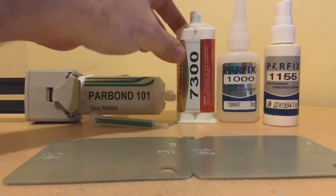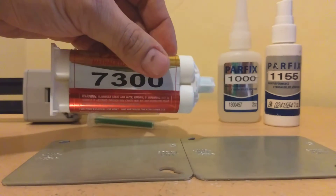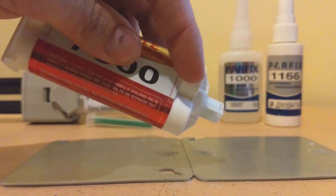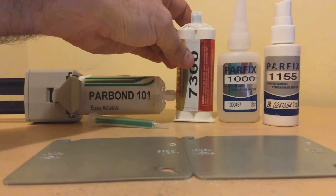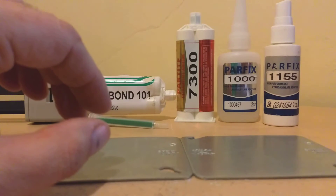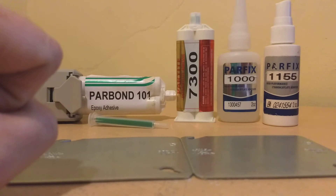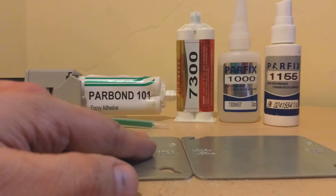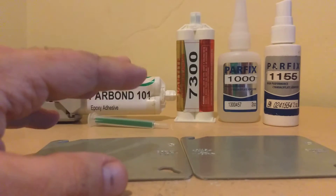If they do not want to clean the surface, we can use a cartridge inside the dispenser and dispense what are called methacrylates. These are two-part as well — you have the resin and you have the hardener. Apply it and in about five minutes it'll be double in strength, in about 15 minutes it'll be strong enough to move. In two to three hours you'd have 90%, and in 24 hours you'd have complete cure. The methacrylates are very handy for structural strength on surfaces that could be slightly oily — no problem.